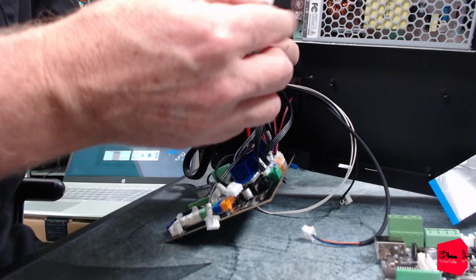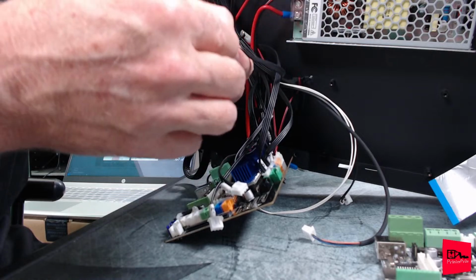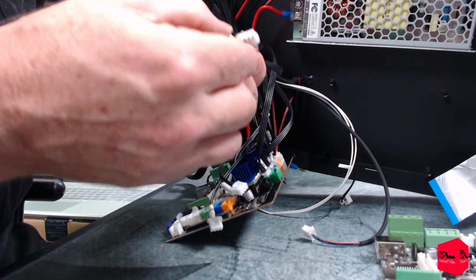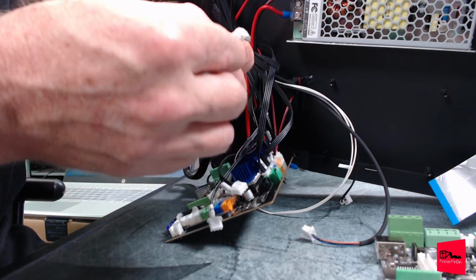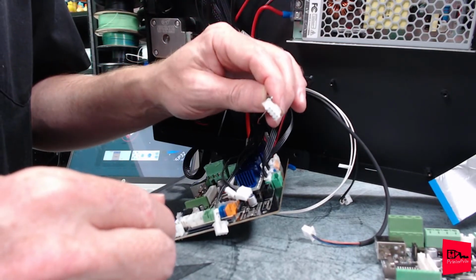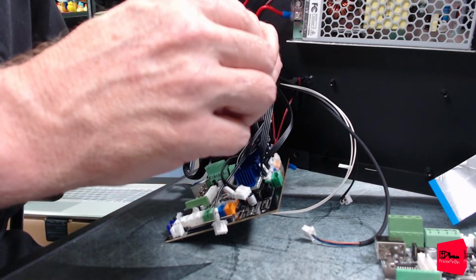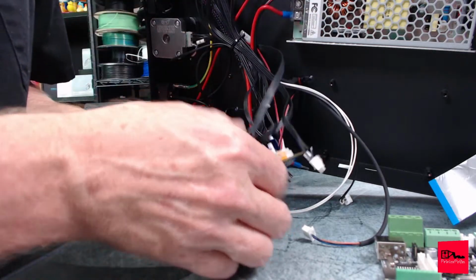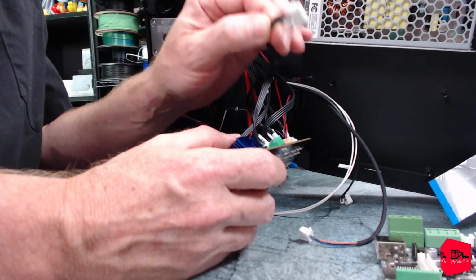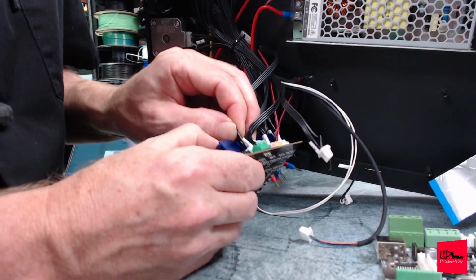Alright. Probably what I'm gonna do, so it's just the one, if I get lucky, not the best solution. I know the proper solution would be to cut all 4 cables and recrimp the ends, stick them back in, but my gosh, that's a lot of work for just one. So I think what we're probably going to do is strip the ends, put some heat shrink on it, solder the wire together, and throw the heat shrink on it. Not much. If this was on the other end of the motor where there's a bit of movement, I'd be a little more concerned, but this is going to be sitting still in here, so we can get this one.